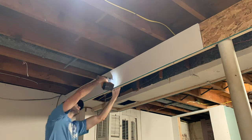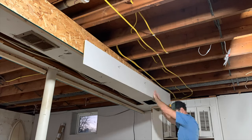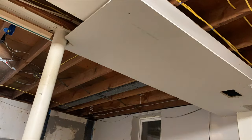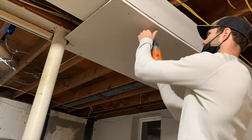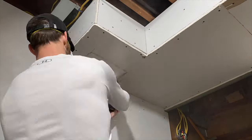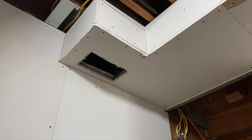After finishing with the framing, you're simply going to install drywall on the vertical sections directly to the OSB, which is super easy. For the drywall at the bottom, you're just going to attach it to the mounting studs on both sides of the duct. Next, it's simply a matter of cutting out the penetrations for your vents and finishing the drywall with corner bead and joint compound.